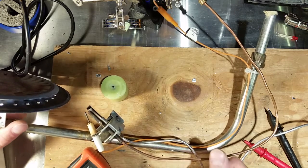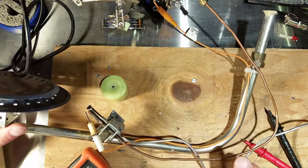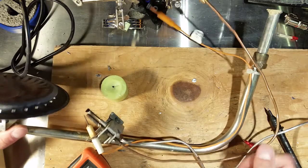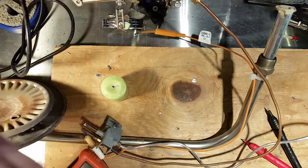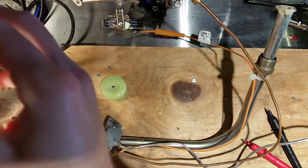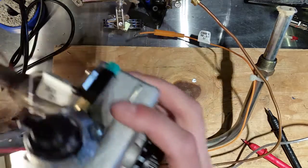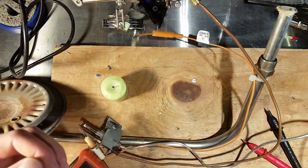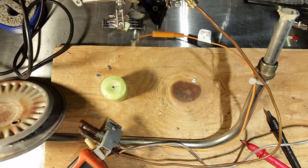If this is a brand new installation that's not working properly, it's most likely an issue with the sizing of the gas pipe or the gas pressure, in which case you'll need a manometer or some gauges where you can hook up. You can test for the correct gas pressure and gas flow. That's a little more complicated, but that's how it would be done. And the person who installed it should have checked it first.